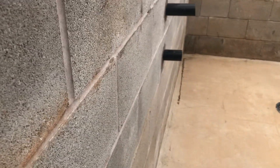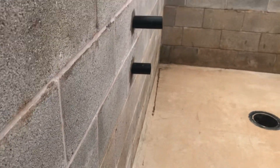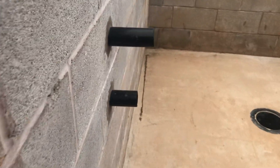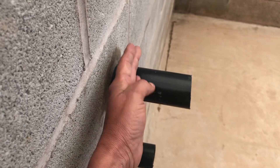Build your walls nice and flat like that, not like burglar bond that I turn up to sometimes where it can climb up the inside to get out of them. Leave your pipes proud by a few inches, or glass onto them, cut them off and grind them back.